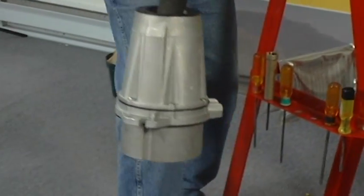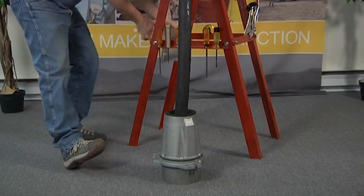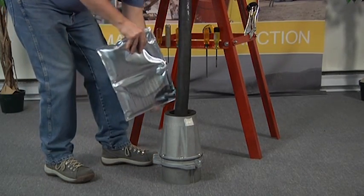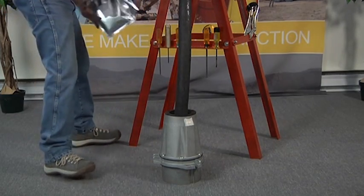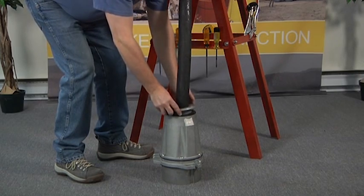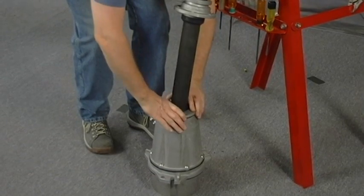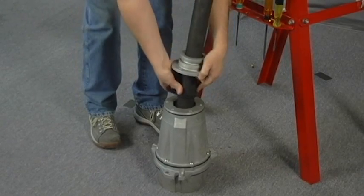As an optional step, potting compound can be installed in the rear body of the coupler. The fastest and easiest method for pouring compound into a cable coupler is through the rear body, prior to installing the entrance fittings. Position the coupler vertically and pull the entrance fitting components and cable aside. Pour compound, ensuring the phase tubes are filled completely. It is recommended that some air space be left in the back of the rear body. Follow the instructions provided with the compound for additional handling and setup instructions. It is recommended that the entrance fitting be installed immediately after pouring the compound to prevent cable movement while the compound sets up.